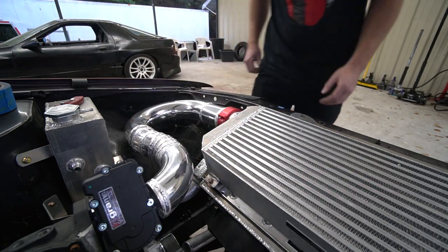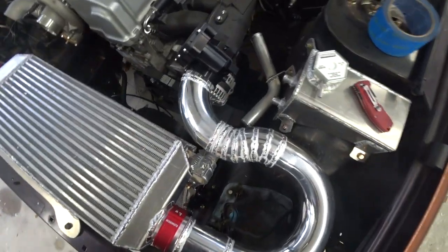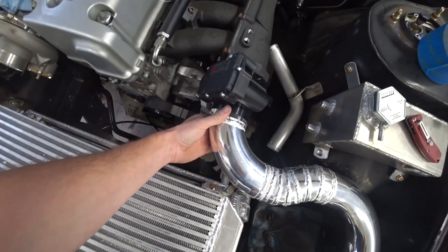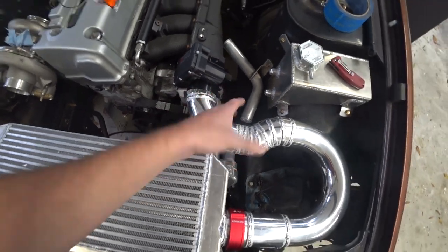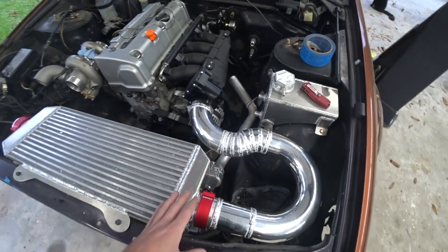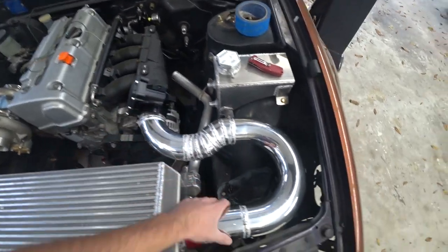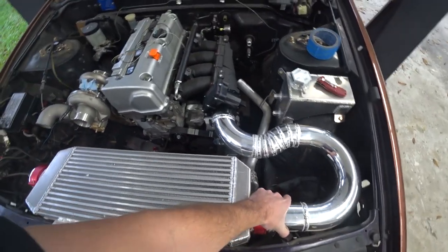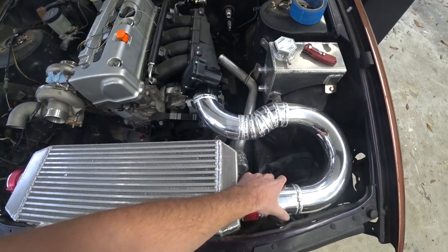That's about as good as it's gonna get. I'm happy with it. Intercooler pipe number one, done and dusted. Lines up really well, all things considered. Figured we would have a little more wonkiness after getting it all tacked together out of the car. I hate tacking stuff out of the car because a lot of times it moves and it doesn't fit right. It's always best to tack stuff in the car, but that's about what it'll look like. It'll be a little more level like that. I just don't have anything to hold up this end. The coupler will though. All right, fine, just sit like that.